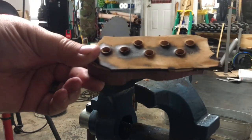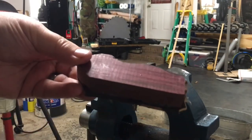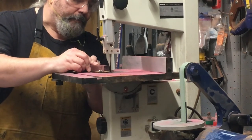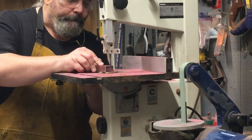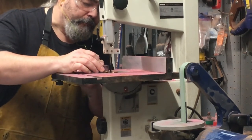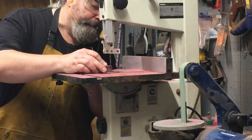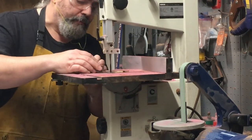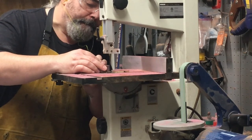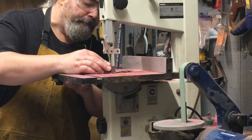It was a little bit raised so I went ahead and put it on a sanding belt for a minute just to get those flattened down. There's the purpleheart side, which I pre-shaped over at the band saw. What I'm doing here is just trimming off that excess leather to save myself time when I glue this onto the knife — I don't want to spend too much time grinding these small intricate shapes with the wood. I just want to get it as close to finished as possible so I can make the handle the shape I want and comfortable for the person's hand.